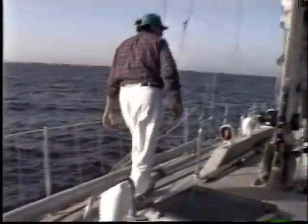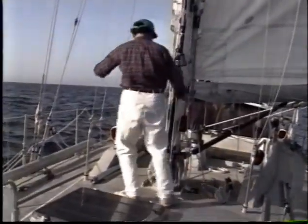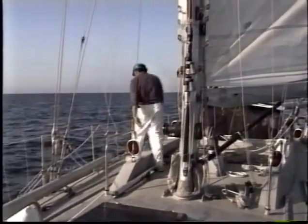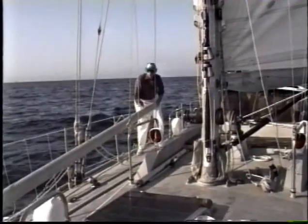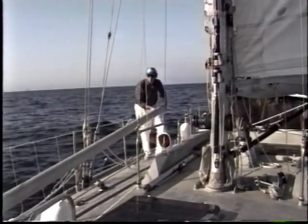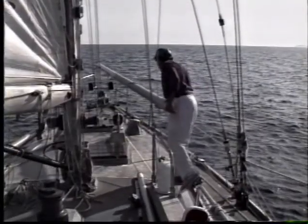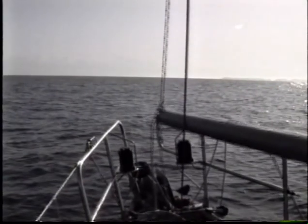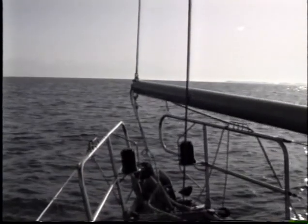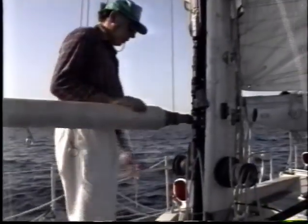As you've already seen, it's not a big deal for us to get the pole onto the mast. The key to our system is stowing the pole well aft. That helps the topping lift automatically raise the outboard end. Because the length of the topping lift is fixed, it forces the outboard end up as Steve shoves the pole forward. You can see it happening here in slow motion. Once the butt end is connected to the mast, the pole is totally under control.